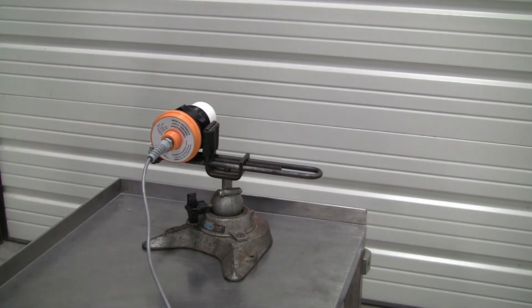To set up for these tests, place the sensor about 5 feet from an ideal target. Ideal target surfaces are hard, flat, and smooth, such as a wall. Make sure the area between the sensor and target is unobstructed, and the sensor is perpendicular to the target.